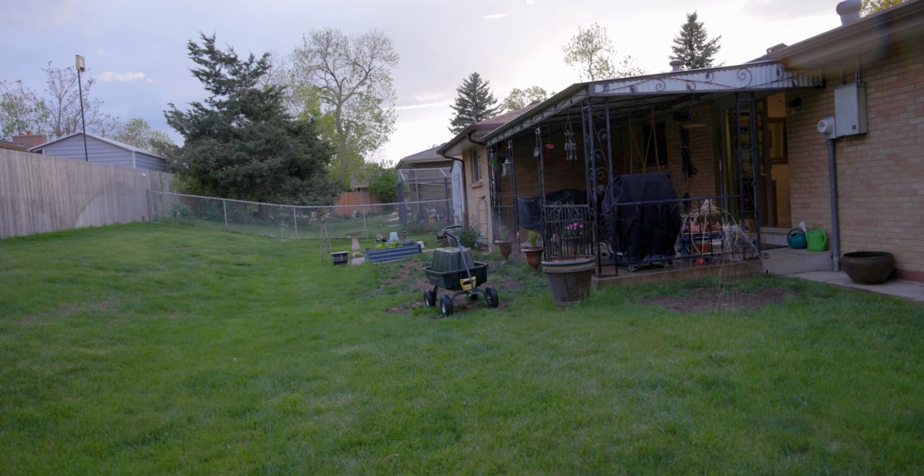I don't know if you can see the movement in the water on the ground right here, but this one does actually look like it's got a leak, which isn't really what I wanted to see, but again, this is a really cheap, crappy head, so hopefully sometime this year we can get that replaced with a 4-inch, not a freaking 2-inch like what's here right now, but a 4-inch ProSpray PRS40. Yeah, I'd say that one's definitely leaking. But other than this one, this zone looks good, so we're gonna go ahead and go on to zone 5.